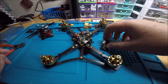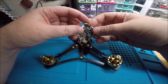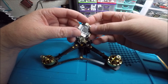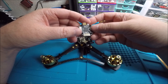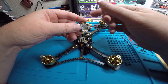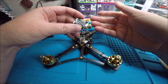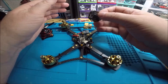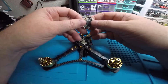The gyro is an MPU-6000, but they have two versions and you can choose between the MPU-6000 or the ICM-20689 gyro — that's one of those ultra-sensitive ones. If you get that flight controller, it comes with the gyro on a foam pad with a little strip and a cover over it. I wouldn't recommend getting that one — I can't say 100%, but speaking from past experience with ultra-sensitive gyros, it just causes problems when the quad is shaking and you just want to fly.